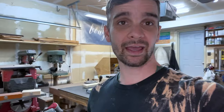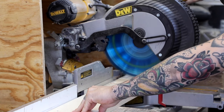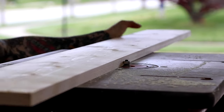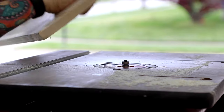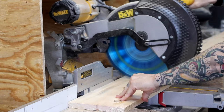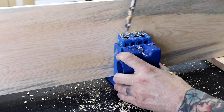It's day number two. Day number one went pretty good — had to call it quits because I ran out of daylight and it was starting to get cold outside. I think after working for a few hours today I should have it most of the way done. I prep my one by sixes, cut them to 60 inches, hit them with the table router, and then sand them. For the one by eights, I cut them to 57 inches, drill pocket holes in two of them, and then sand them.